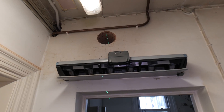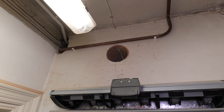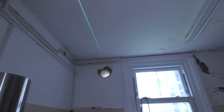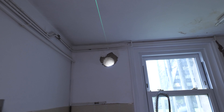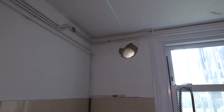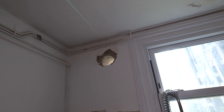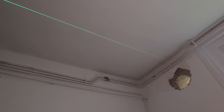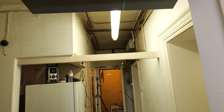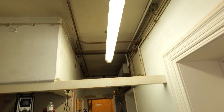Yesterday we spent a lot of time taking that old boiler apart and coring through to accommodate this new flue. The biggest pain was this one up here — that's a nine-inch concrete wall, and I'm not joking, that probably took me about three hours to get through. As you can see we've got our laser set up, just making sure we get our boiler center exactly right with our flue holes.